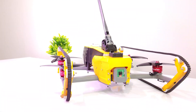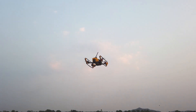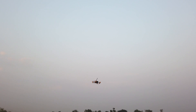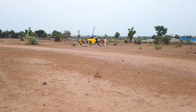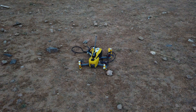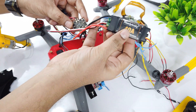The drone is completed and ready for the first test flight. For the initial test run, it gave me a series of rough landings in strong winds, but on the third attempt it flew smooth. The yaw was working perfectly. But as soon as I thought it was flying well, suddenly all the motors stopped and the drone crashed — followed by another crash, and another. In total, I broke 6 arms. The cause of the crashes was the ESC: it got too hot and, to prevent damage to the MOSFETs, it cut off the current.